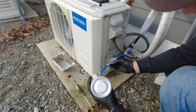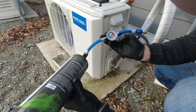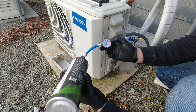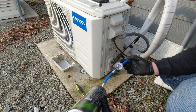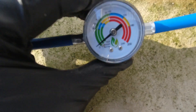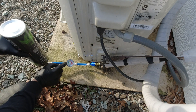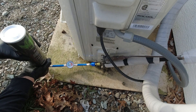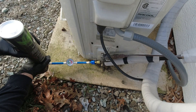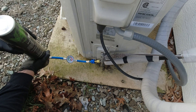The unit is spooling up at 62. We are targeting getting the outside ring into the blue on the gauge — this gauge covers R410A, R404A, and R22, with R410A on the outer ring. Green is too low, blue is perfect, yellow is overcharged, and red means call your service provider. Before we get started I'll show you the gauge — you should register at least a little pressure. We'll use small bursts. You can see we're now landing in the middle of the green. She was definitely low — I'm hopeful we have enough juice in this can to get the job done.